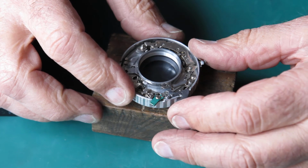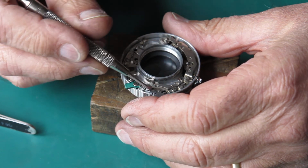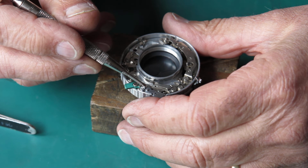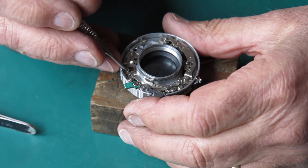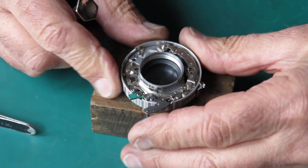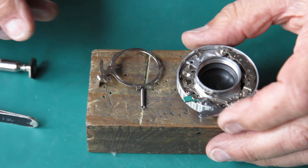If you press the shutter release, it'll bear on this lever here. That lever will allow that arm to swing underneath, which, because it's got the spring on it, will be pulled forward. That will drive the wheel, which will move the flash contact and everything else. Like that. And that would have released the shutter. But the shutter itself is driven from the main lever, this piece here.